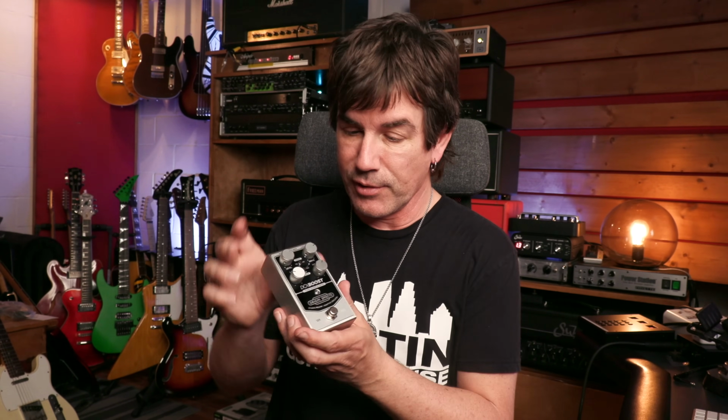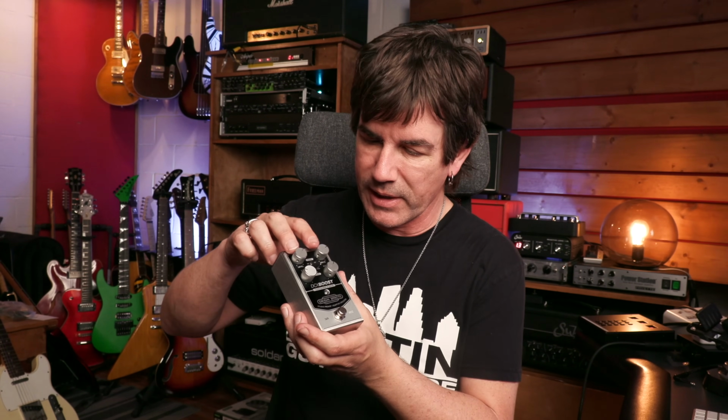So one of the really cool things about it is that it actually, like a guitar pedal, has a drive control and a level control, just like this pedal does. So the front end drive on the 610 will allow you to crank up the gain, and then you can lower the back end volume control, and you can overdrive the preamp and get a real cool, gritty analog tube character out of the preamp. This tries to replicate the sound of that circuit in the 610.